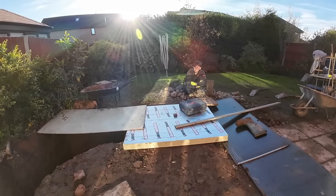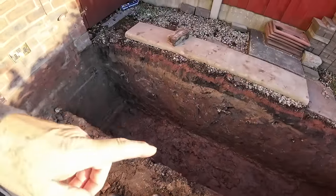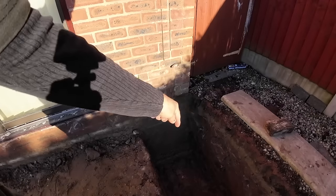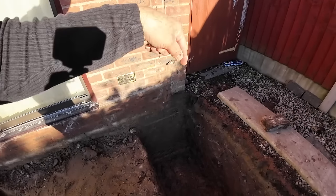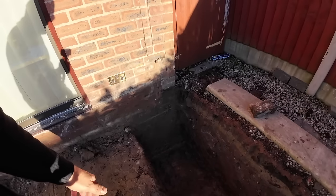It's not horrible sticky, is it? It's quite all bone dry, isn't it? That was horrible and sticky. This is horrible and sticky. This is where there's not water in the ground. Whenever you dig a foundation, when the strip foundation is backfilled, the water always gathers in what used to be the trench because it's never solid around where the cut was. So, because we've opened it up, the water's naturally made its way out into the open end.